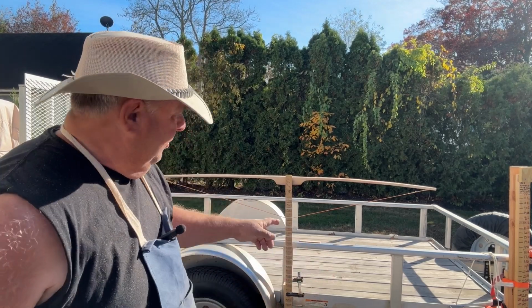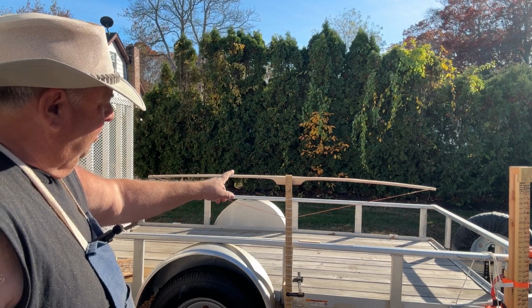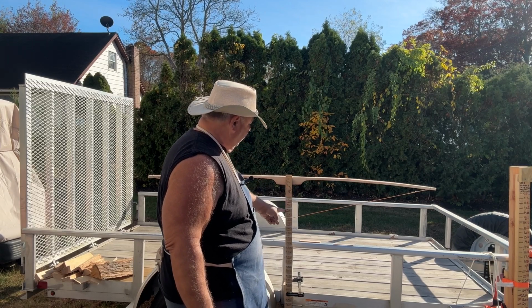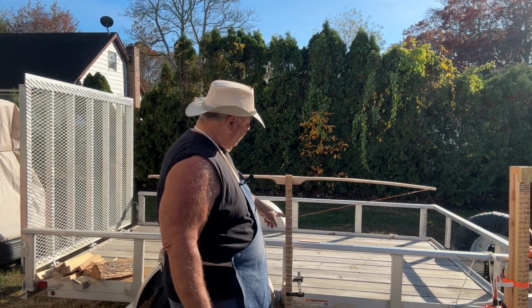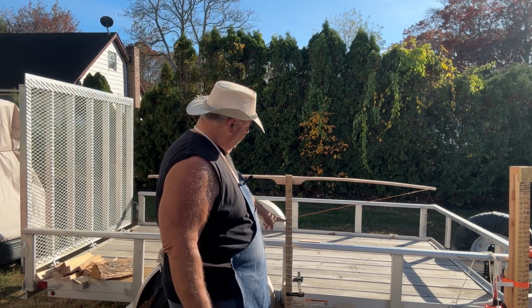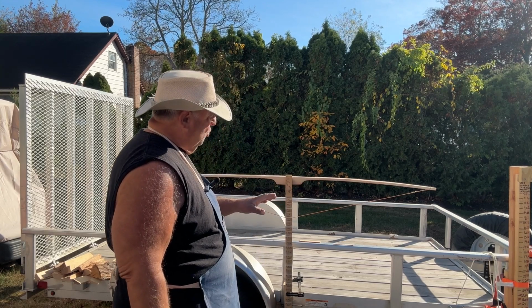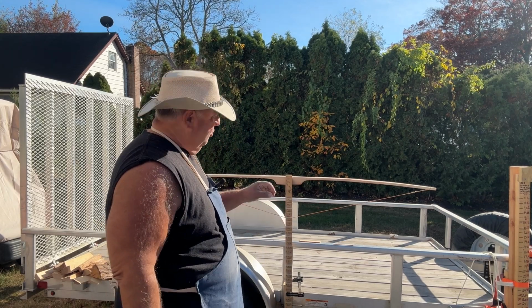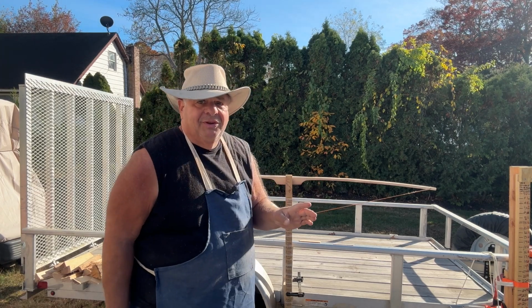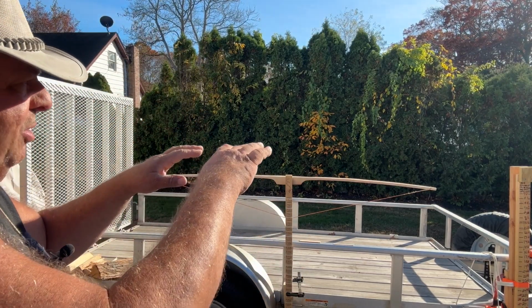The other thing I wanted to tell you was, you see my pull-down stick that I have? You see the numbers? Those numbers are measured from the bottom of the riser to the notch that this slides up to. So you see the arrow pointing up? This is 6.5. See this one here, 7.5 with a loose string. It's just to show you where you're going with the loose string. So you can repeat it every time, and go down 1 inch at a time. It'll take you a while, but you go down 1 inch at a time to get that perfect bend.